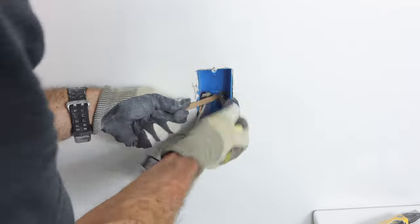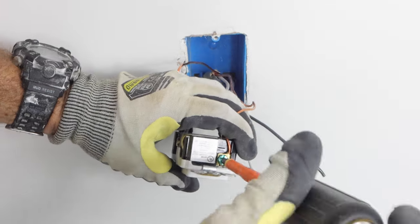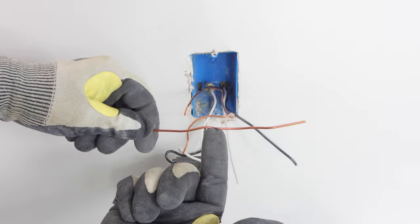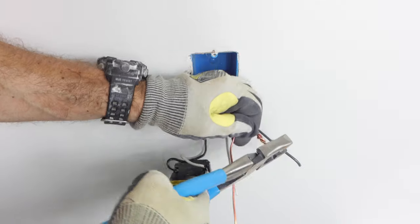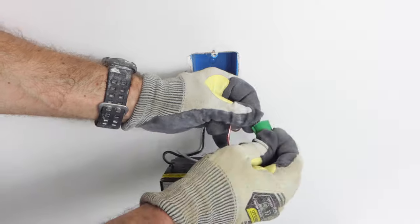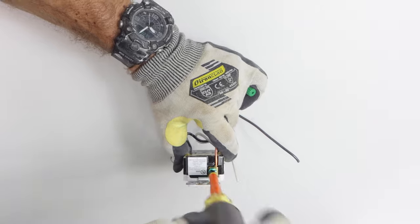I did the exact same thing up at the original work box, but I need to wire the ground a little bit differently. I'm adding a new third wire, pigtailing that, and then connecting the two grounds together using the right sized wire nut. Then you take that one wire, put it into the ground terminal, and tighten down on that.